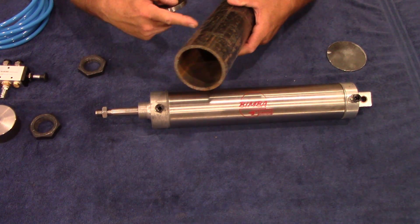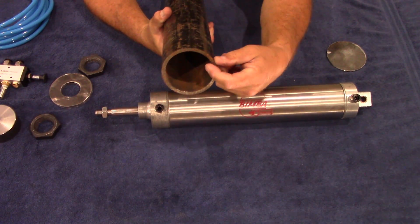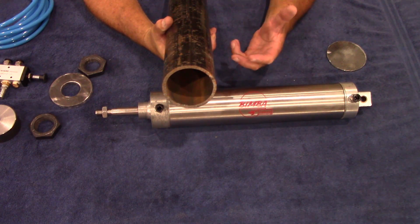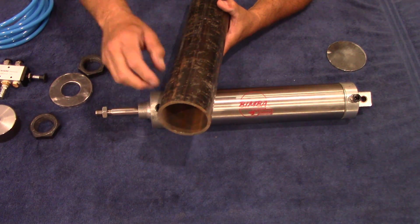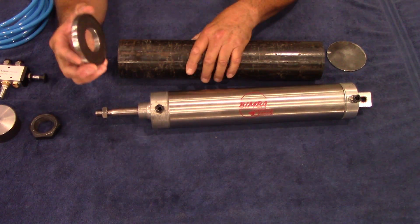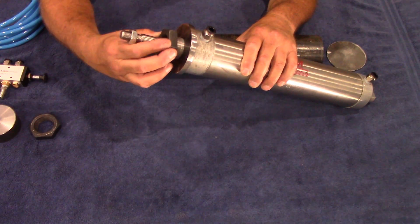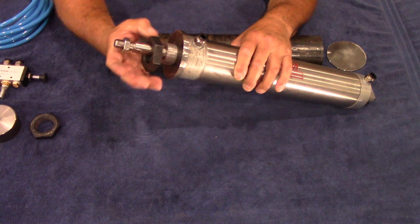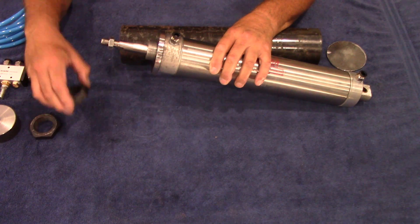For the tube, you could use a piece of pipe — this one's totally overkill at three-eighths-inch thick. You could get away with eighth-inch thick; I like quarter-inch as a happy medium. You could also use a piece of four-inch square tube and just cut out the top. You have two ends: one end takes the cylinder and your nut holds it on, or if you have access to a lathe you can machine and thread that piece instead of using a nut.